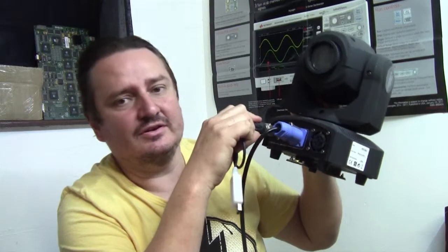But if I use the five pin connector, it's not going to go in. So I'm going to show you. We're going to take the connector off this Magic DMX full dongle and put a three pin connector on — and it's easy as one to one, two to two, three to three. This means you'll be able to use the Magic DMX full interface with cheaper lighting equipment and cheaper cabling that already has three pin connectors.